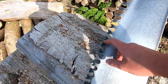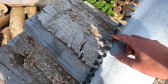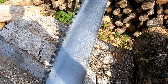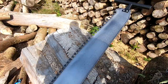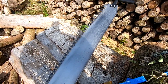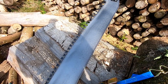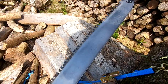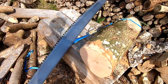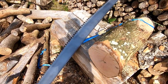The M-Tooth saws are also easier to use. You still need good technique, but it's a much easier saw. It doesn't jam up as badly or as often. When you're sawing, you have to keep the saw as flat as you can and try not to bend it, because as soon as you don't keep it flat and straight, it just jams up and really breaks up your rhythm. So it does take a bit of practice to use.